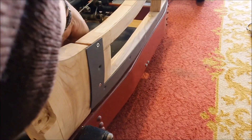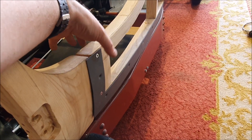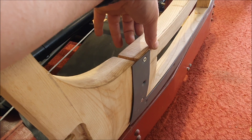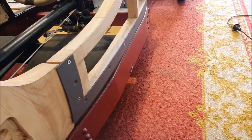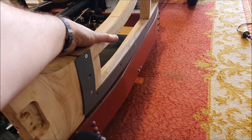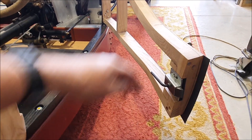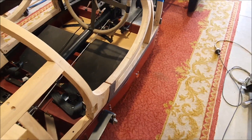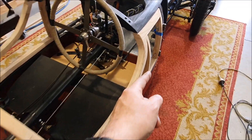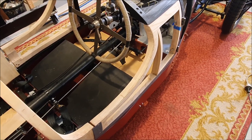That's what I mean about the rattle — it does do the two-click thing. So that's half latched, and then that's fully latched. With the shims I've got in there it's probably about a sixteenth of an inch — almost the right amount. That's very satisfying. It's taken a lot of work to get to this point — to get them nice and solid, fully adjustable, and working. I'm going to do the next one and then I can start working on the little arm, the mechanism, and the little bracket that will go up here for the door handle.